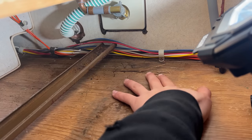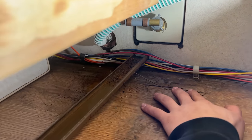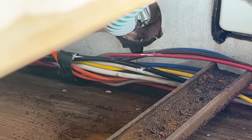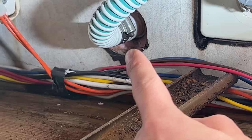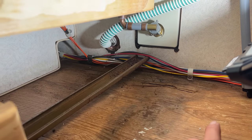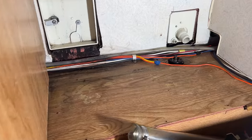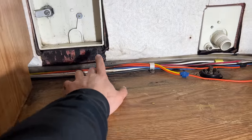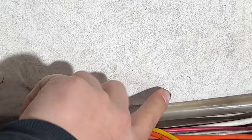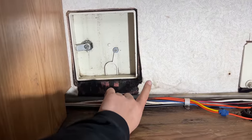That corner back there clearly has some water damage, and this entire cabinet just has different spots that indicate a lot of moisture getting trapped in here. A lot of the wood is just rotted out and no good. This is definitely the worst of the damage I found — this entire floor is just moist, the wood is just coming apart with water damage, it is really bad. The drawer slide is all rusted and old, and all of this is just rotted out and in terrible shape. I'm guessing it's the sink runoff or the water fill-up station causing the leak.